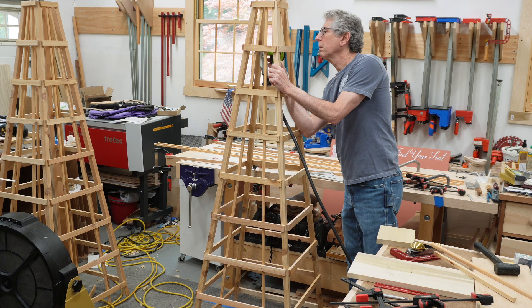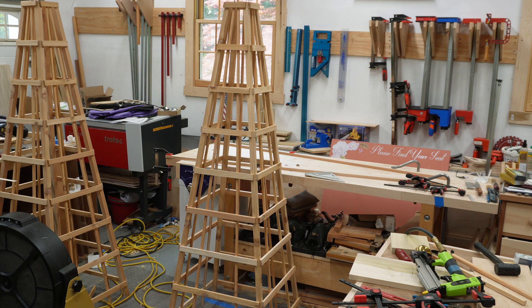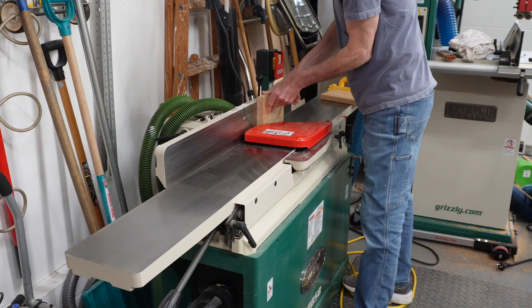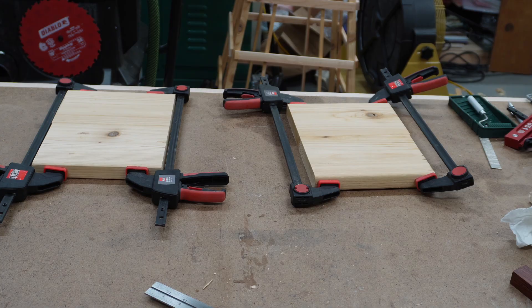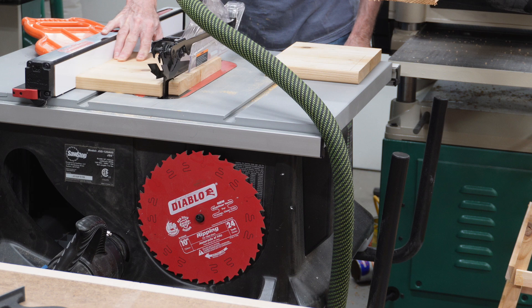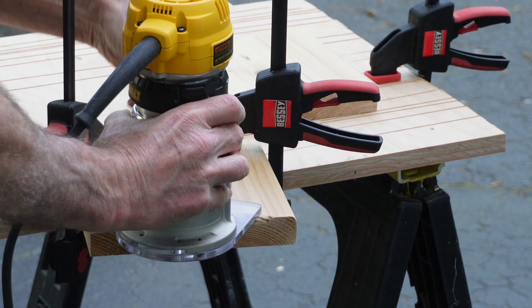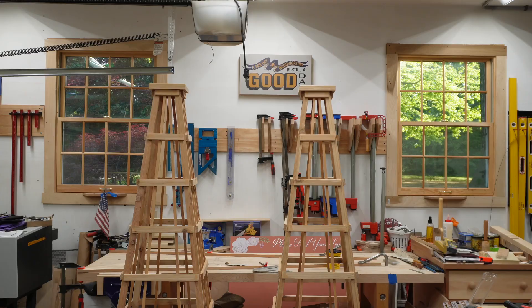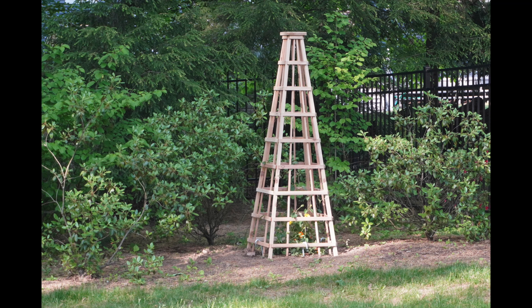A few enhancements make a really big difference to the end product. I wanted to make a shelf for the top of the assembly, and the width exceeded the width of the boards I purchased, so I had to join a few pieces of decking to achieve the size I wanted. I cut a few pieces on the miter saw, joined the ends on a jointer, glued up the pieces, and let them sit for a while. When I removed the top, I cut it to size and added a roundover to the top of the shelf to ease the edges and soften the look. I installed the shelves on both assemblies using an inch-and-a-half stainless steel nail into each of the legs from the top. Here's a picture of one in the backyard. Thanks for joining, and I'll see you next time.